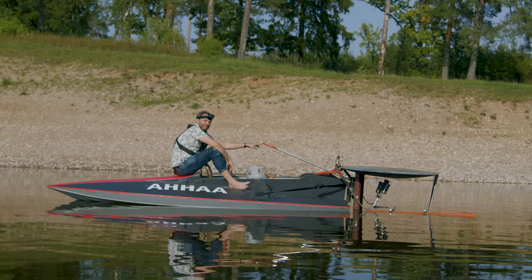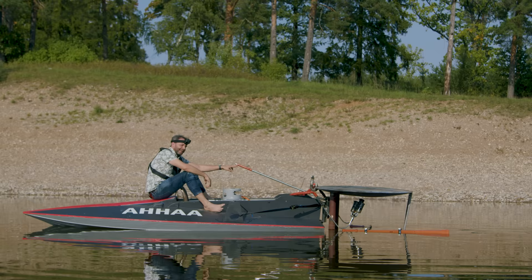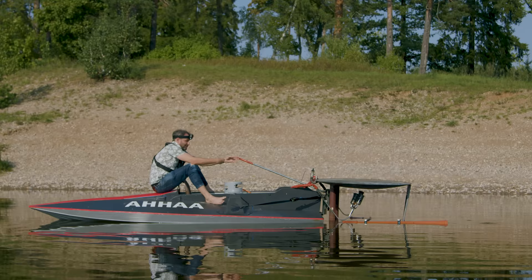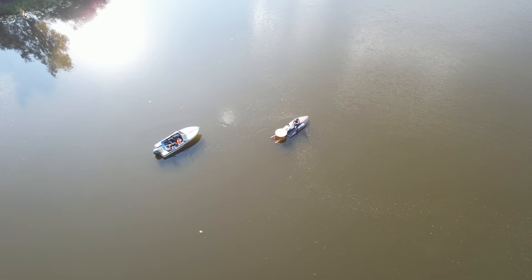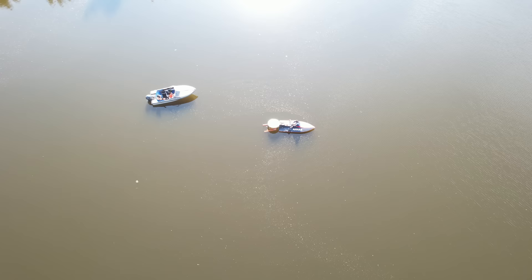It's really nice to see that metal plate coming up and down — that's the frequency of the engine. It's so much slower than the toy pop-pop boats, which make that high-pitched pop-pop sound. So interestingly, the fact that that metal plate can flex makes the engine less efficient, because the water inside that tank is boiling into steam. That expansion of gas forces water out of the tubes at the back — that's what provides propulsion. But if the vessel can expand with the steam, that reduces the amount of water being propelled out the back. This boat is about the same speed as a toy pop-pop boat. Only it's massive.